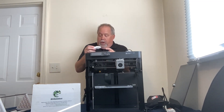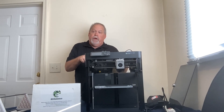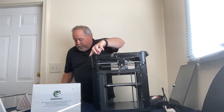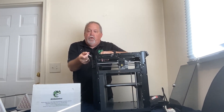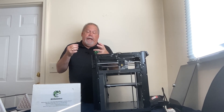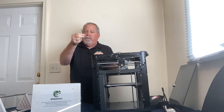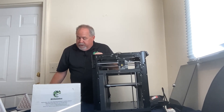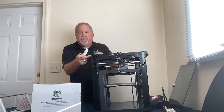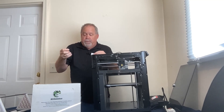You're going to need a few tools for this install. You'll need the tools that came with your P1P. On the back of the printer, where the PTFE tube feeds in, there's a little guide held on by two 2mm hex screws. Use your 2mm wrench to remove those. You'll also need a 2.5mm hex wrench because we're attaching our switch holder to those same screw holes — our head is 2.5mm versus their 2.0mm.